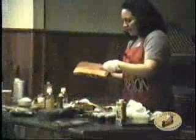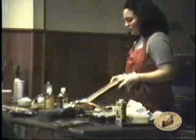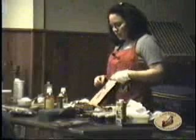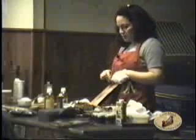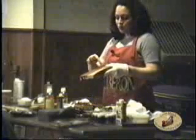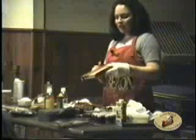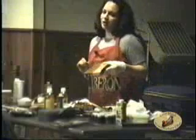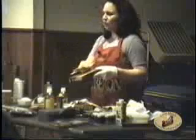You need a burn-in stick, which looks kind of like a screwdriver. You see that? And what you would do is, if I had a gouge here, a little nick, I would get my matching color, and I would take my heated burn-in tool and melt the proper stick right into the mold. And then you have to sand it so carefully, and you will probably damage the whole area around it. Then you have to bring it down to your surface, and then maybe you can bring it back with wax. But it is the hardest finish to repair. So that's why you want to protect it.